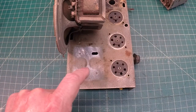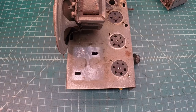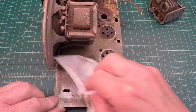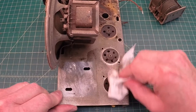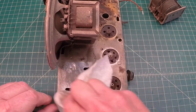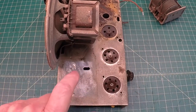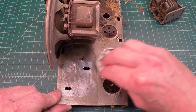I'm going to go ahead and take advantage of this. I just want to clean up a little bit of the chassis and see what it looks like. I've got some rust right here — just see how well this thing cleans. One of my favorites to use is just some water and soap — that's one of your best friends. I've got some disinfectant wipes here, and that's probably not a bad thing anyway, in case there have been any little critters running around. This looks pretty good. It's amazing how well it cleaned up underneath where the tuning condenser was, and that's just wiping only.